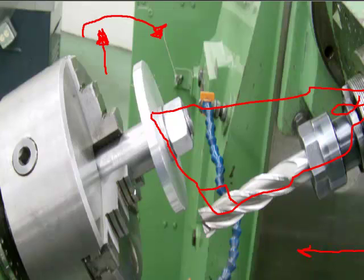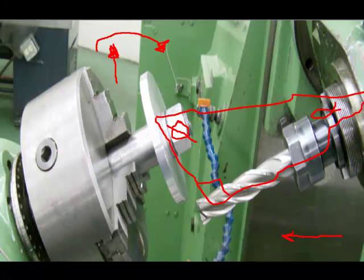In this case here, because we need a 2-inch lead of cam, the dividing head will need to be set 30 degrees from horizontal. This angle here is the angle of the spindle from vertical. So 30 from 90 will leave 60 degrees, so that spindle will be tilted 60 degrees from vertical. And then we can start to cut the cam. The end mill needs to be at right angles to the face of the cam, or the outside diameter of the cam being cut will not be parallel to the axis of the cam.